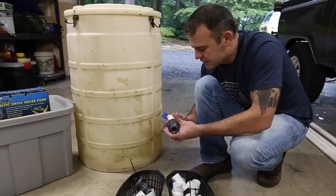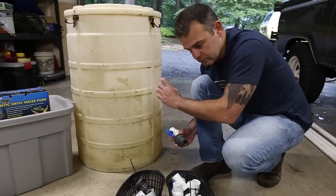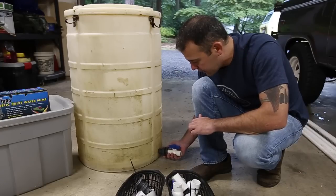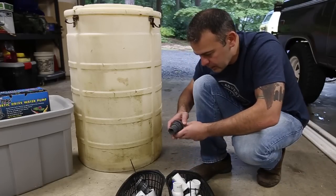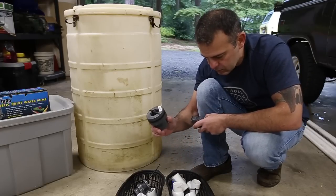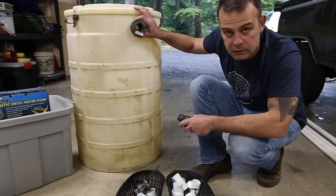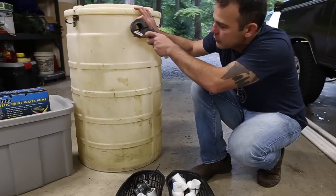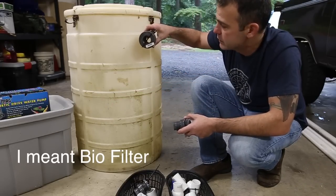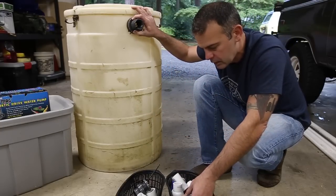You put a very similar one. No, let's go to the outlet. We talked about the inlet of the water, so 1-inch pipe. We talked about the bottom, the drain out of the bottom of the barrel here, okay? Then I'm gonna have an outlet, okay? And that's gonna be, say, here, pretty high, all right? And that's gonna take the water to the mechanical filter, all right? And it's gravity fed, all right? So once you put that in there, that just carries the water through and it's pretty simple.